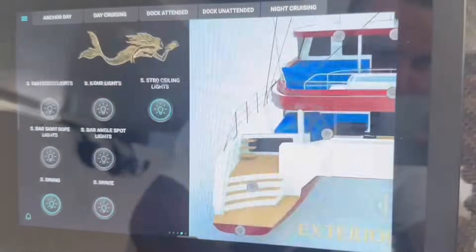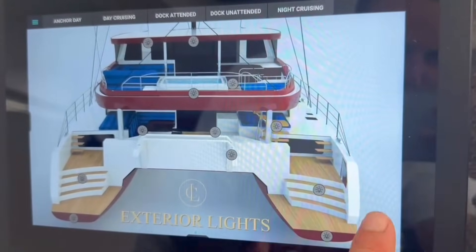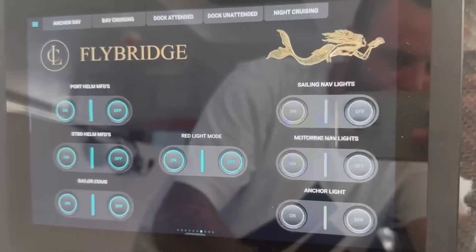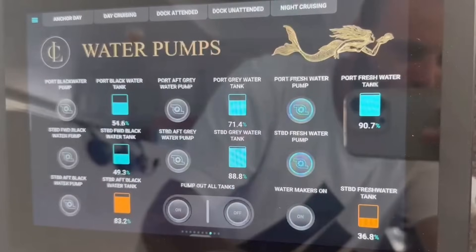In the main salon we have quite different scenes set up — dining, movie mode, and entertaining mode, which only turns on the bar and center overhead lights. We were actually able to take one of the 3D renderings of the vessel and surface-drop all the individual light buttons on top of it, so when you hit one of those buttons that is the exact designated light that comes on. The utility lights screen covers functional exterior lights for the transoms and spreader lights. The fly bridge screen has a red light mode — a scene that turns off all other lights and puts on just the red navigation lights so you can see while sailing at night, without running around to adjust other switches. There's also a dimmer function associated with all these buttons.